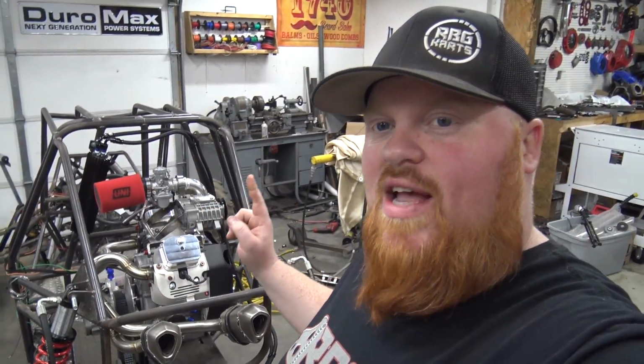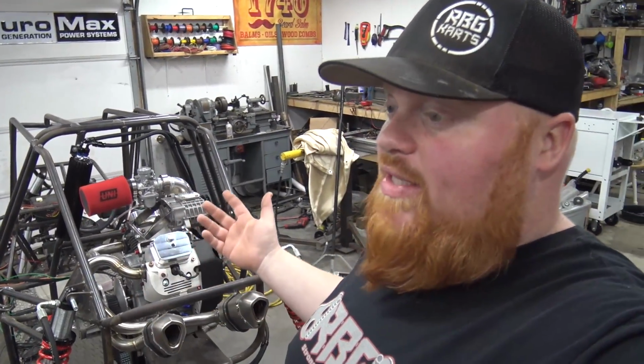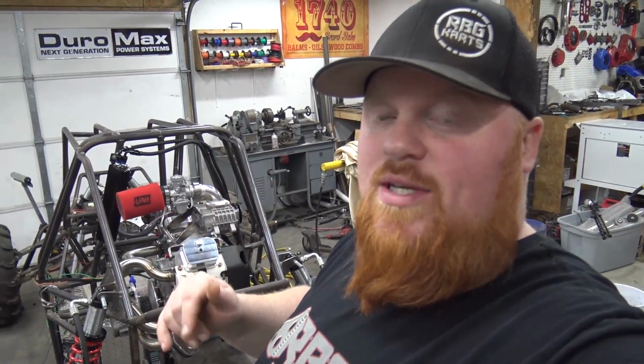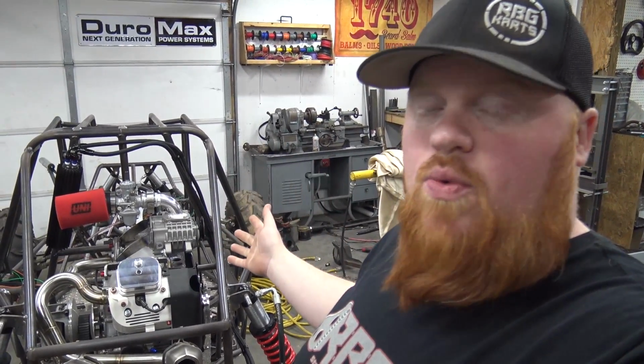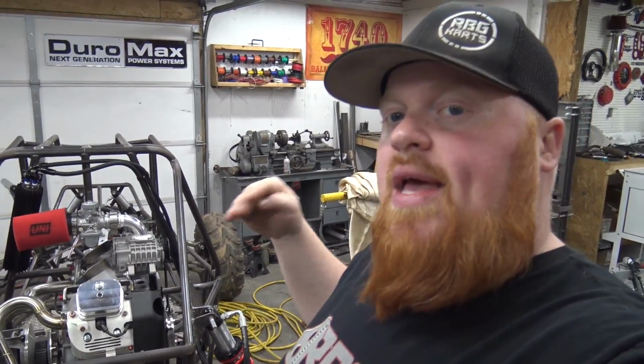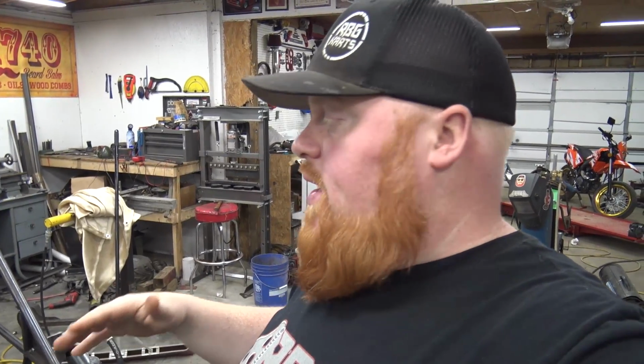Well, guys, thank you so much for watching today's video. This thing turned out sick, and thank you to the people that told me to flip it that way. Just one of those moments where, when you fabricate stuff, we've done this before, we'll mount something and overlook a better way. And we love you guys giving your input, because it would have been a lot harder, and our intake would have been unequal length. So now we can basically use a stock intake manifold and just port match it to the heads, and also port out where it hooks up to the blower.